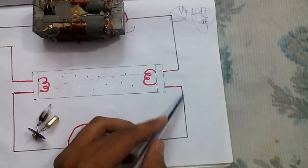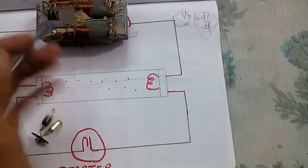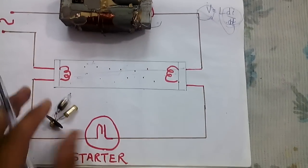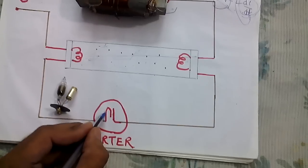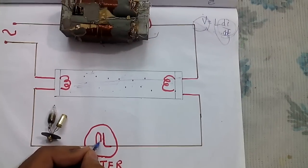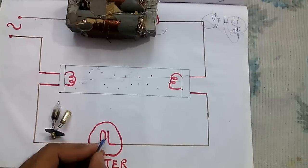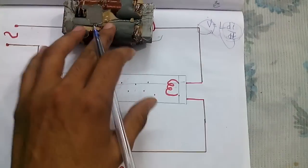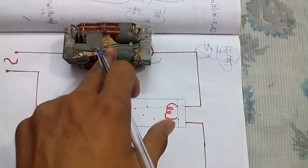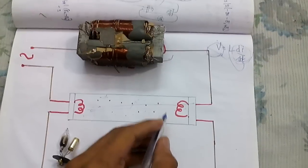When the circuit is connected, there will be current flow through the tungsten cathodes, and these will heat up and heat up the gas. There will be no light inside the tube yet, but it will just heat up the molecules of the gas inside it. Now the main part: when these strips get cooled and get apart from each other, there will be a change in current in this circuit, and a high voltage shock will be given from this inductor coil.